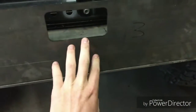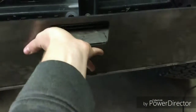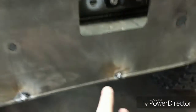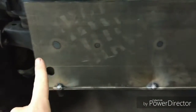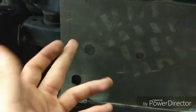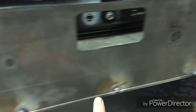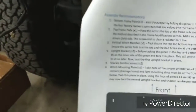To get no gap I'm going to use a floor jack and push it up, then tack from the inside outward — tack here, then here, then here and here. Number three is tacked in. There was an awkward spot so I put some weld material on this plate. Those tacks are in and the next step is number two in the directions.